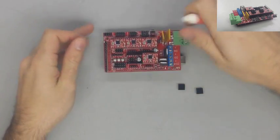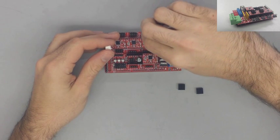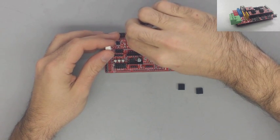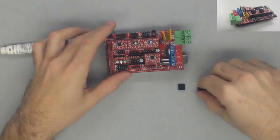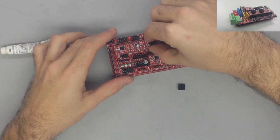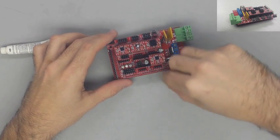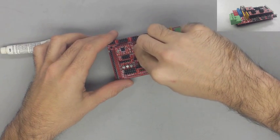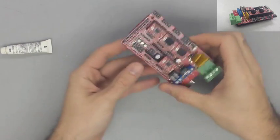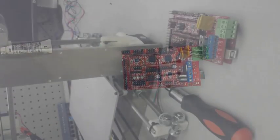I'm only doing it for the X and Y because the movement these two motors coincide with gets a lot hotter, since they do a lot faster movements and change pace a lot, and that causes overheating. So heat sinks are very important for those two stepsticks in particular. It won't hurt to have them on the others, but you need to at least have them on those two. Whether or not you do it now is irrelevant.